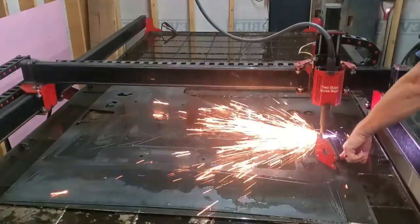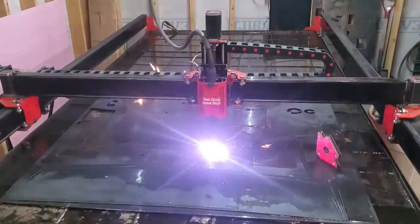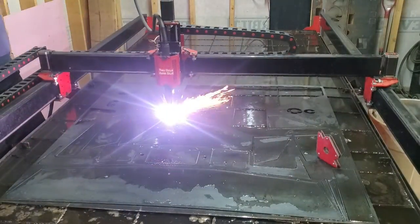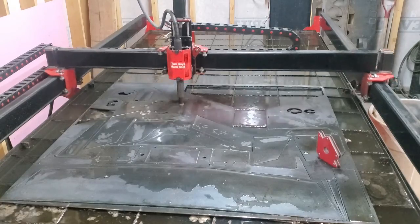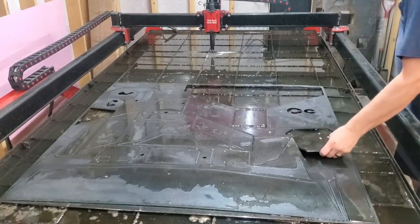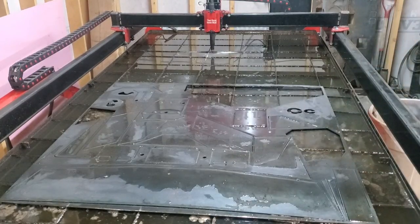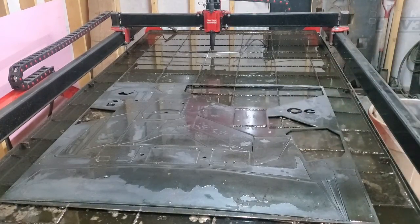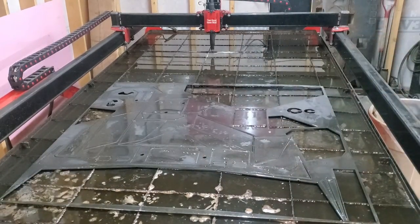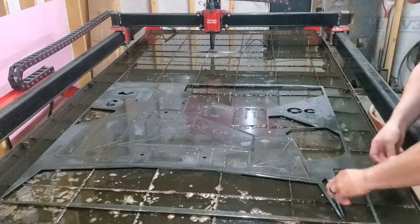Just a 'gee whiz' moment: don't get frustrated if you're operating a table and something doesn't go quite the way you wanted, as long as everything stays where it was when the cut started and nothing's moved or the table hasn't lost zero. Here we go cutting those relief cuts — and even though I put a magnet in there so I wouldn't lightsaber my finger off, I obviously went and stuck my finger in anyway. But everything worked really well. Even though the cut profiles were in the wrong order, everything turned out fine, and as you'll see in part two, everything bent up real nice.